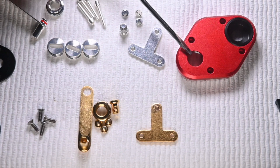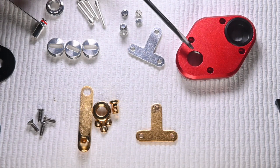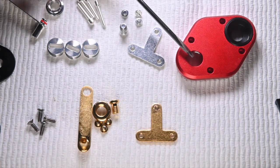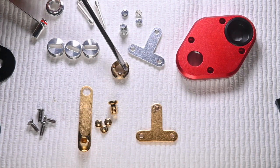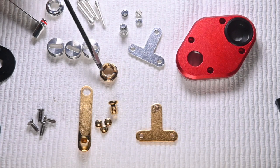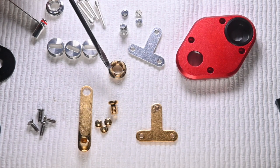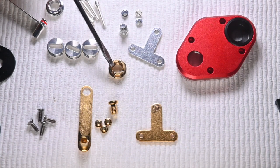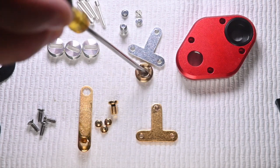So I went ahead and removed my 510 connection. Remember, when unscrewing it, do not turn it counterclockwise or anti-clockwise. To unthread the 510, you have to turn it clockwise from the top. Okay? From this area here, the top of the device, you have to get your screwdriver in these female cutouts and turn it clockwise. Turn it clockwise to unthread, okay? Normally it's turning clockwise to thread on anything in the world, but this is reverse threaded in a sense because you're turning this clockwise to back it out instead of to thread it in. So try to remember that.